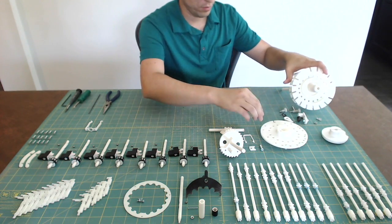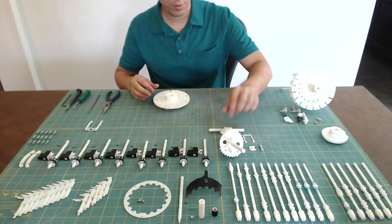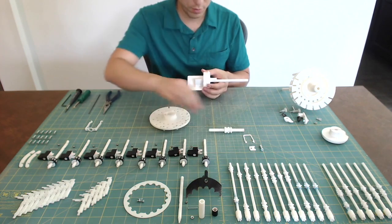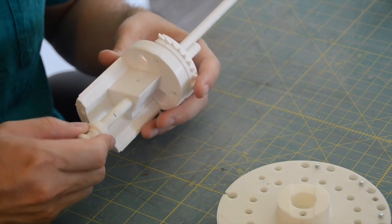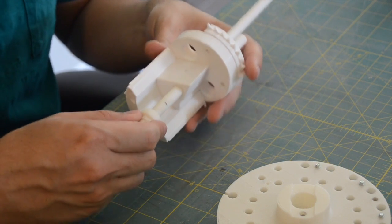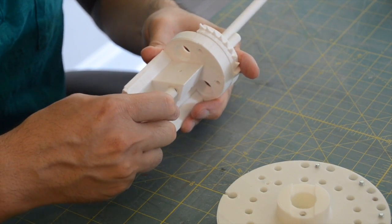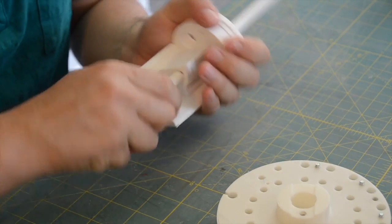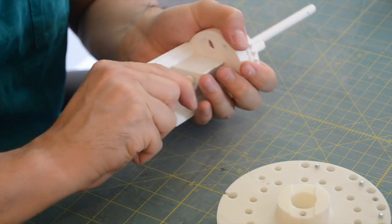I am now ready to begin assembling the bearing plate and step drum. The bottom of the main axle slides into the bottom of the step drum. Note that the top of the shaft is to my left with the teeth facing down. In this orientation, the flat side of the flanged portion of the axle faces me. The fit should be snug and should not rotate.